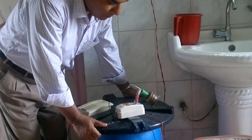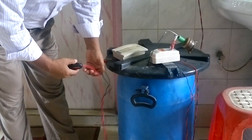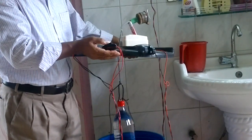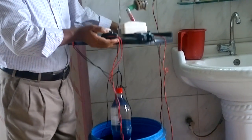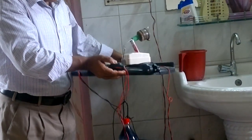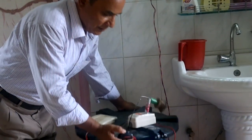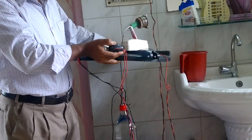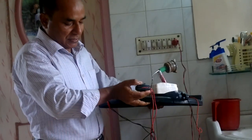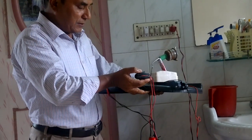And at that time, the buzzer will sound the alarm. See, here is one switch. No alarm now. But when the water tank will be full, the switch triggers. This is the simplest method of how to make a water overflow alarm. Before overflowing water, this method will alarm that the water tank is fulfilled.